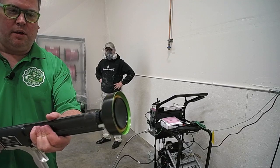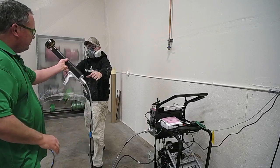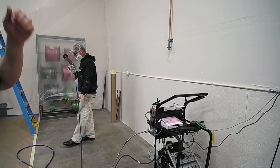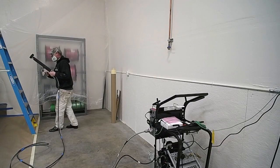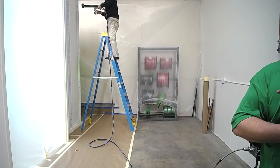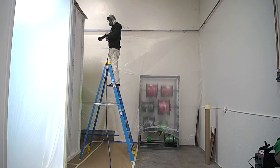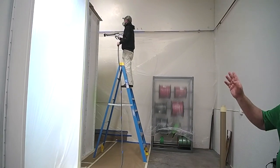When I hit the trigger, paint would be dispensed. I'm going to give this to Mike — he's got his respirator, his safety glasses on, and a bare-hand connection so that he's touching the ground. We're going to go ahead and start painting our paint booth, which has already been powder-coated. We're going to paint over top of the powder coating, which addresses a common question: will electrostatics work on top of a previously painted surface? And the answer is yes.